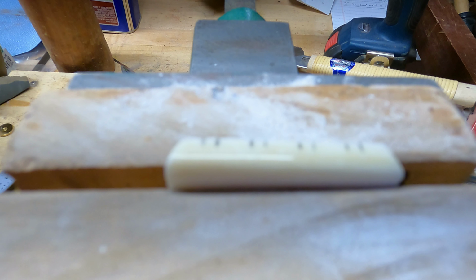We took those and we started working. We joined up the top, we joined up the back, cut them to thickness. We set up our neck blank, we bent the rosewood sides, and we fit them into a form to hold the shape. After that, we installed blocks, we installed kerfing, we installed braces on the top, we installed braces on the back as well, and then we shaved the braces on the top.